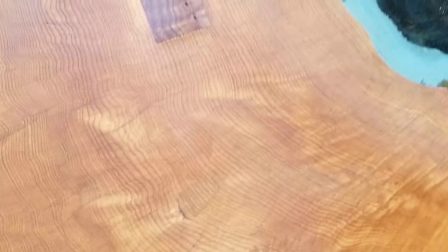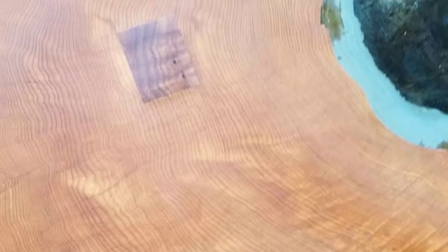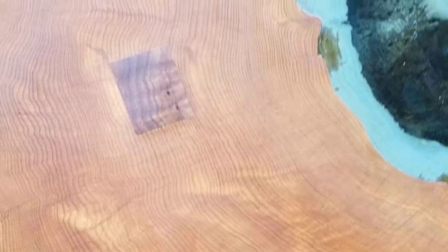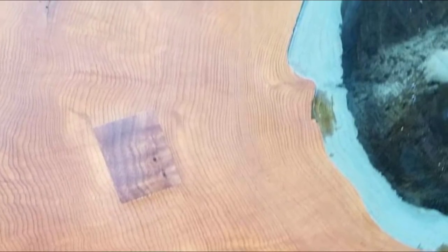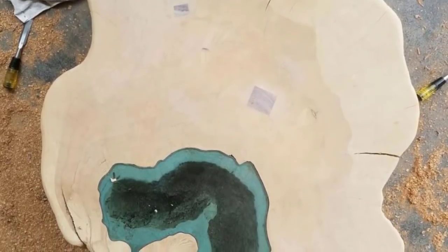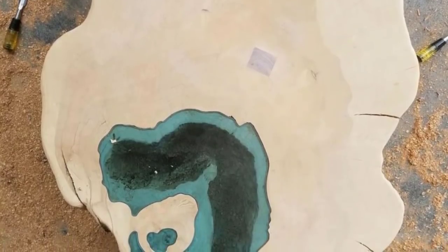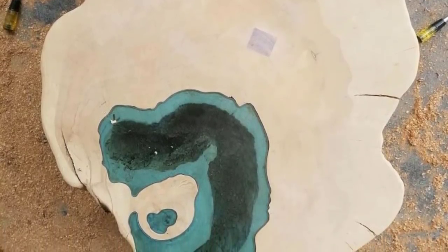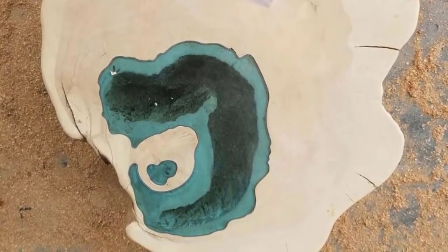Earlier, when Brent was routing the stump, he had made that little chip. Before he could go further, that would need filling in. So he cut squares from figured walnut and tapered the bottoms so the bottom had a smaller footprint than the top. He traced the squares onto the slab over the gouges, used a plunge router to carve out the shape, then hammered the tapered wood squares into the fresh-cut holes — and voila. Those purple squares were his patches.